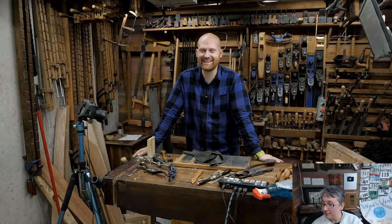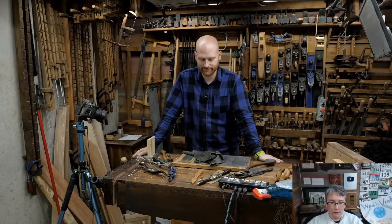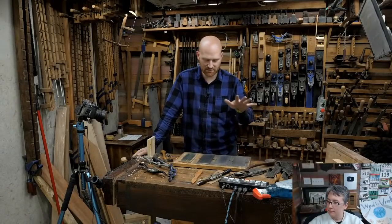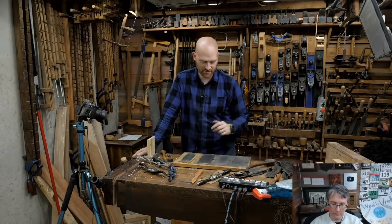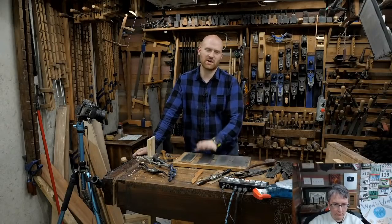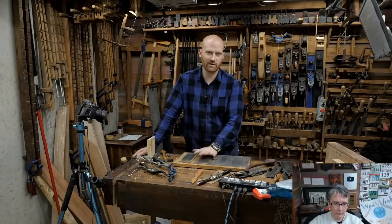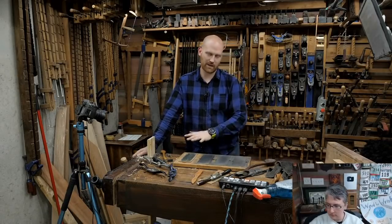Ugh. All right. Chris Peters, what grits are those three sharpening stones you're using? If you want to see this, in the video where I made this and several others, I actually have links to the exact irons. But whenever you talk about diamond plates, do not talk about grit. They don't cut the same way, and they're not corresponding to grit of whetstones or sandpaper.